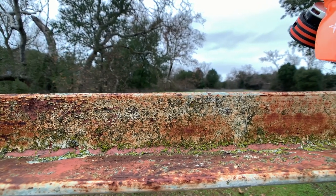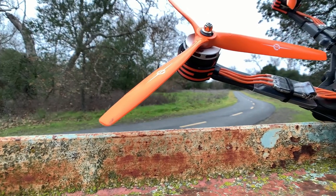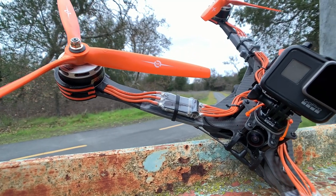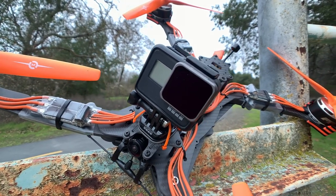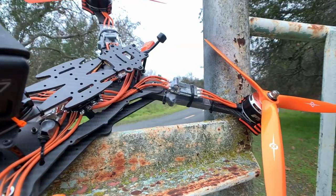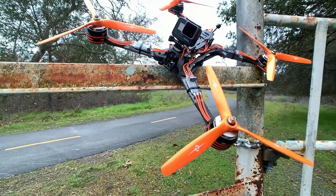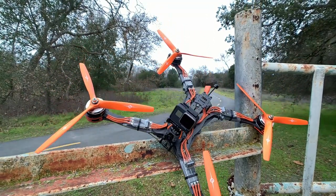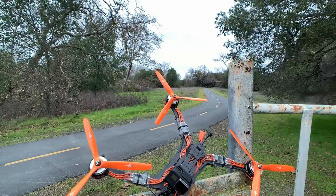This is a really quick video, but I did want to show you that I am taking the feedback you've left in the comments and implementing it into this build. The ultimate end goal is to be able to fly the Hildebeast as fast and aggressive as possible without turning this thing into a huge fireball. Thank you all very much for the comments and all of the help — definitely looking forward to getting it back out onto the field and seeing where we can take it, possibly even changing out the motors from the F1000s over to the Brother Hobby T10 Pros running at 330kv, which would enable me to jump this thing up to 12s.